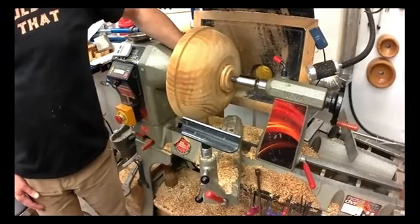John, this is Dean. I've got a question. When you're doing that fine adjusting, are you adjusting the tailstock side or the headstock side? Because what I find sometimes is that I'll have the tenon fairly well-centered on the tailstock side, but if you're off on the top side of the bowl, when you fix your tenon and then set your bowl, it's so lopsided — the top side of it isn't centered. You've done yourself a lot of harm. You're taking off a lot of wood from the bowl.